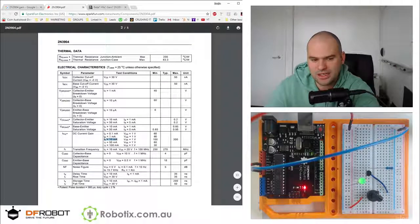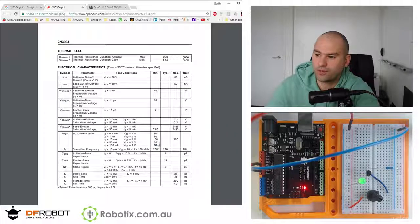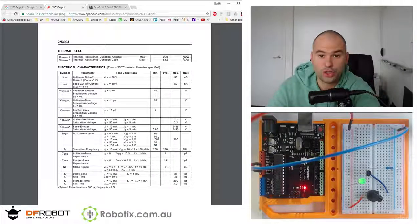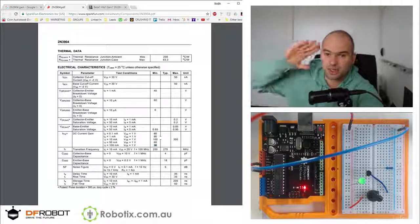10 milliamps is a reasonably bright LED, but the gain goes down to a minimum of 30 and a maximum of 300. So if you want precise amplification, you're really going to have to pull out that voltmeter and do some testing. But if you just want to amplify a current and control it using something like this, then your standard transistors are the way to go. Okay, that's it. See you in the next tutorial.